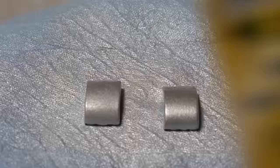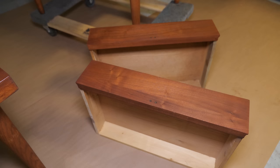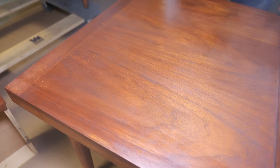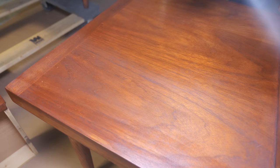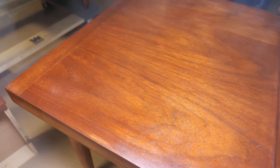For the finish, I chose to use lacquer. Lacquer is a very picky finish to use when it's humid and you're not able to blend the lacquer with other products to control blushing, which is what happens when moisture gets trapped in the finish. I do tend to use lacquer on smaller fixes because most furniture is finished using a lacquer and I do like the feel of this finish. To spray this as my finish, I had to keep my garage door closed the entire time and the dehumidifier on until the finish had hardened up.